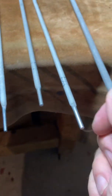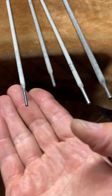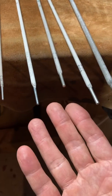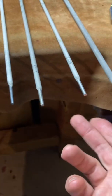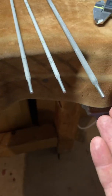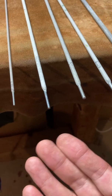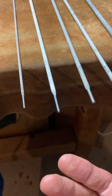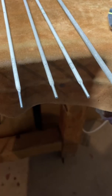So you have all these rods here, all different sizes, and you've got to weld with them. And so, what do I use? What amperage do I use here? This may confront you on a weld test, where they say, here, you're using this, and you're like, well, what do I do? Of course, in the lab, we use 7018s. They're 1/8 inch, and you'll be told, you set to 125 amps, and there you go. Well, why do we use 125 amps?